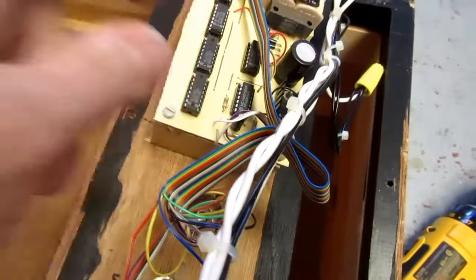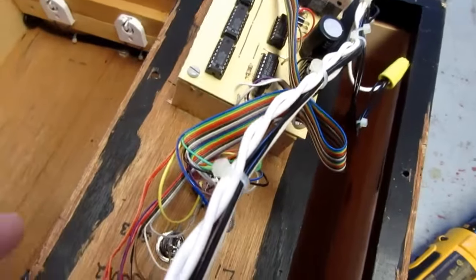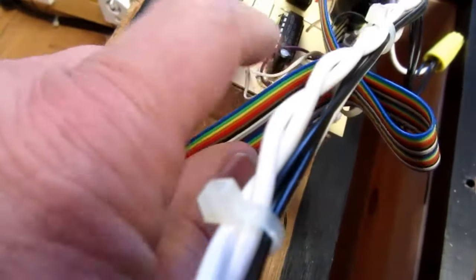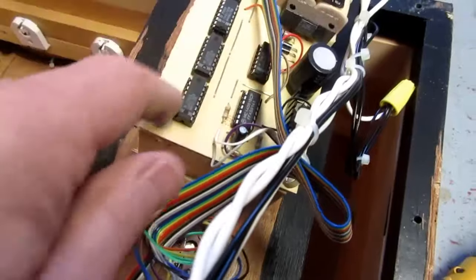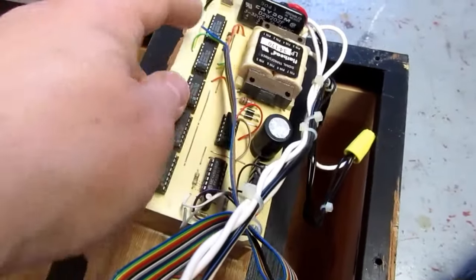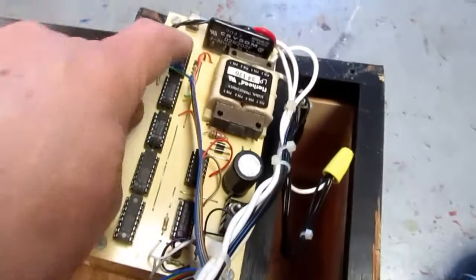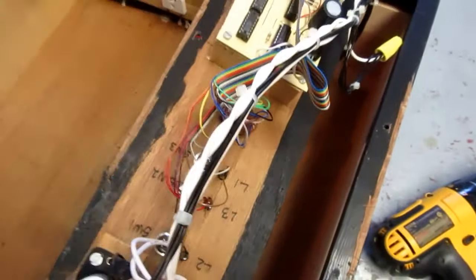I suspect that's just a counter chain. There's probably a low frequency oscillator with this capacitor here. I imagine this is the clock, and then there's a series of counters that are counting up, and then different points get tapped off with the selector switch, and then there's a flip-flop probably down on the last stage that handles the set and reset. So I imagine that was my approach.